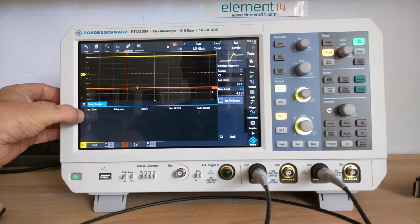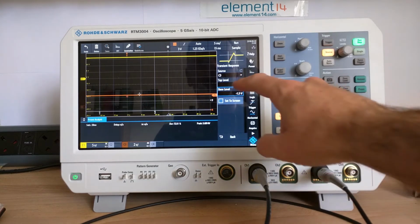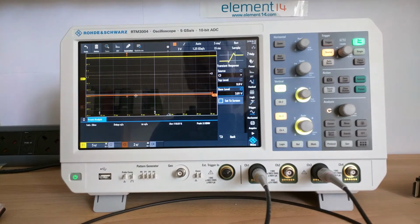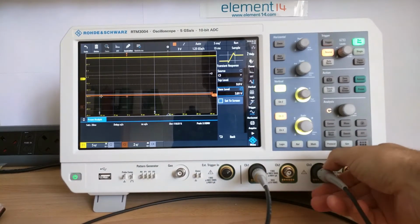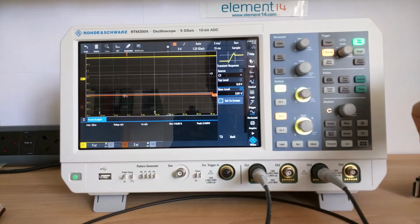To be honest, I think the problem is that I've not got a differential voltage probe, but it doesn't really say anywhere other than just one line in the manual that this might be a problem. I should be able to measure transient response on a DC-DC converter with the supplied probes, but things just start going very strange when I try. This is probably the only place where I found the usability of the scope is a little off. If it said perhaps you're not using one of the approved probes, then that'd be fine. But there's nowhere it does that. It just sort of starts behaving oddly.